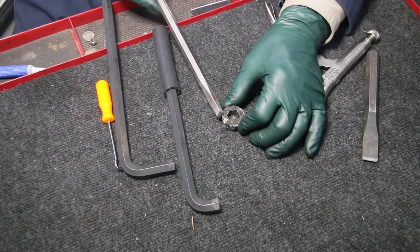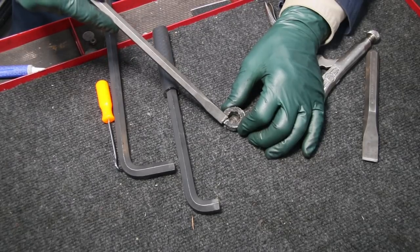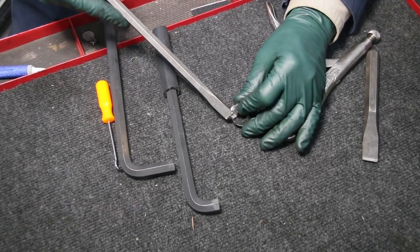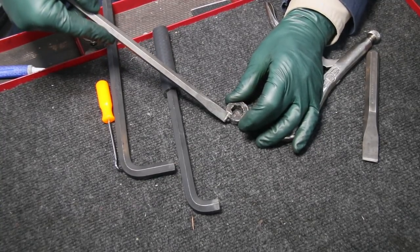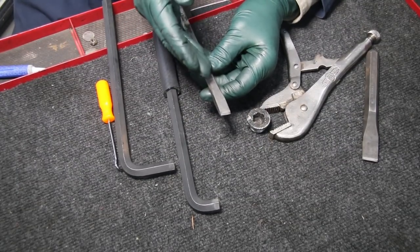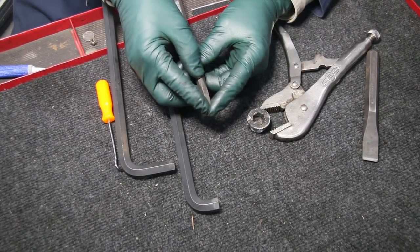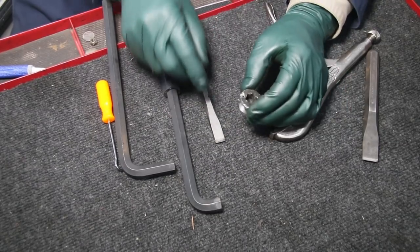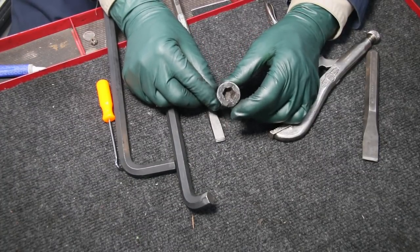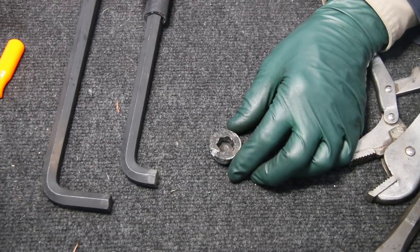It takes a little technique — you can't just get on the edge. You have to start on the edge and then rotate it in. As you can see, I've driven down deeper and deeper into the metal of the plug to get a really good bite, so I was really able to hammer on that chisel to break it loose. I have about six chisels in my toolbox sharpened at a really sharp angle, in different sizes, for getting various screws, plugs, and bolts out in real stubborn situations.